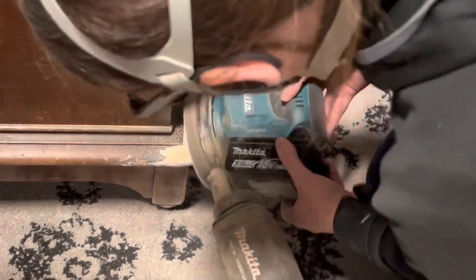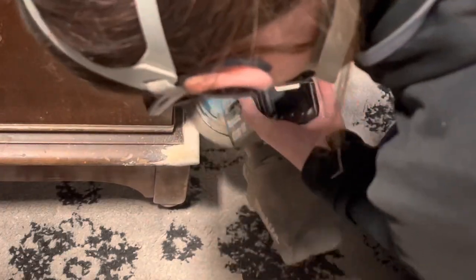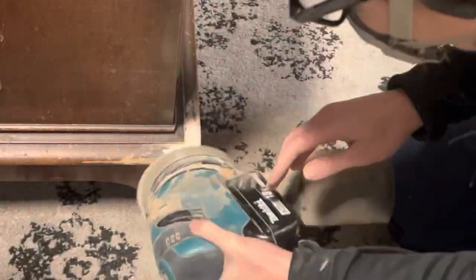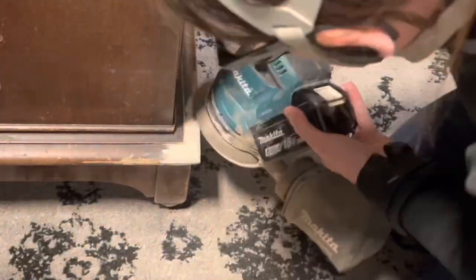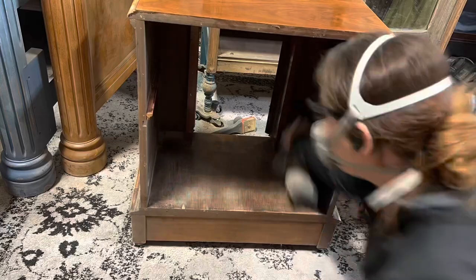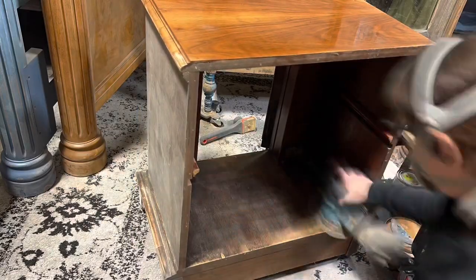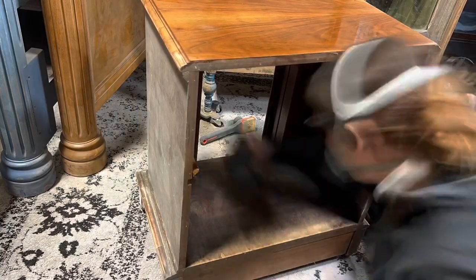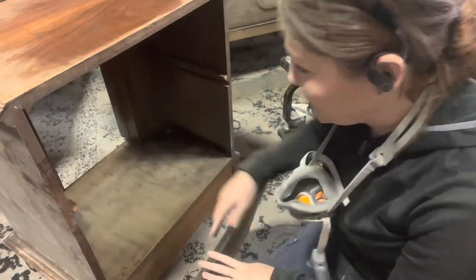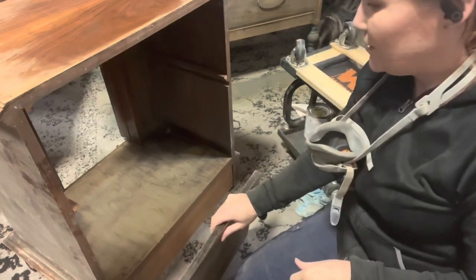So again, this is sat overnight. The putty is fully dry and hardened. So I'm just shaping it. I'm getting off the vast majority of it with my orbital, and then I can go back and hand sand it to make sure that it's perfect. I'm impatient, so while the top's doing its thing, I'm going to go and give the entire thing a scuff sand. I just wanted to show you guys something fun in my adventures of sanding this out, which was terrible